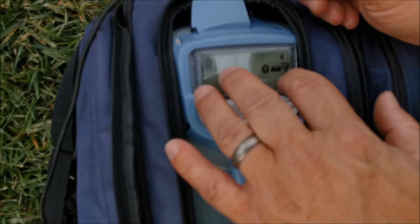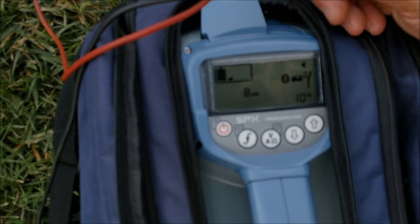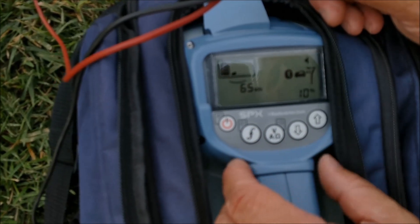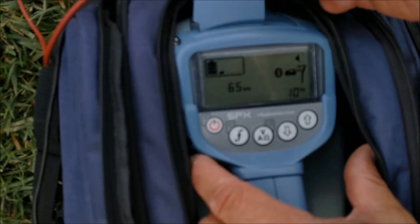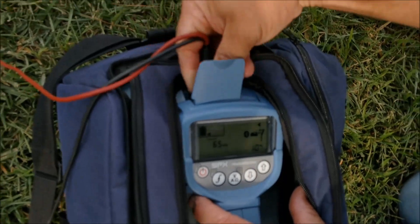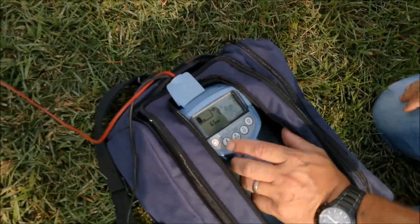The induction method is when you unplug the cables and place the box over the top of the utility that you want to locate. The animation on the screen shows it's throwing signal underneath the box — it's trying to jump signal from this box to whatever's underneath you. You've got to use a higher frequency to do that because higher frequencies bleed easier, and that's what you're trying to do: bleed signal into the line. It's always better to hook up direct, though — hooking up direct will allow you to use a much lower frequency and it's going to go a lot further because you're going to get a lot more power out onto the line.